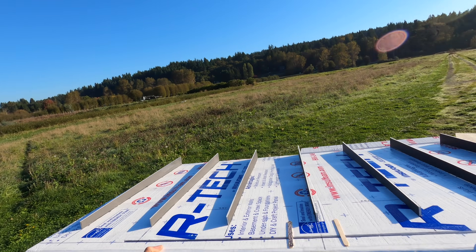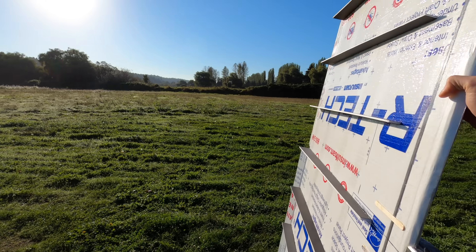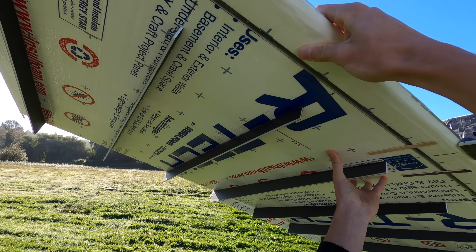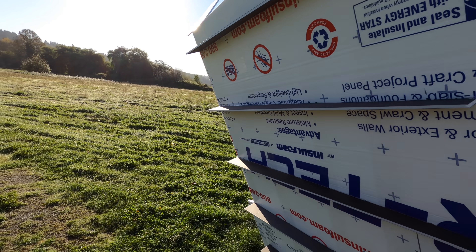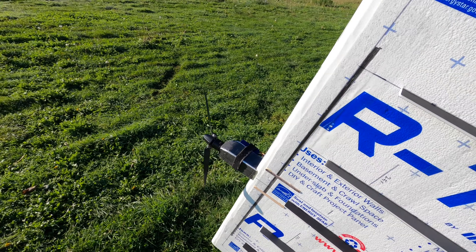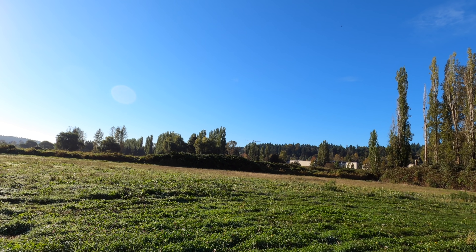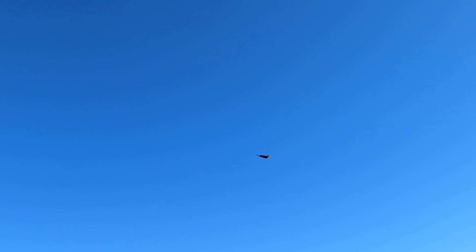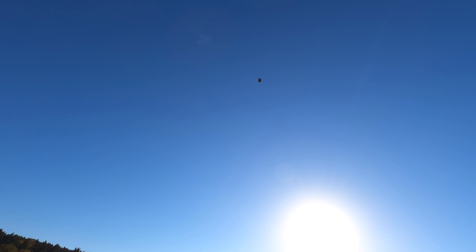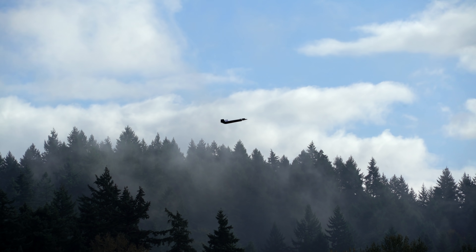Today I've got some vertical pieces of foam on the bottom to stiffen the wing on the pitch axis. They're an inch tall in the front and two inches tall in the back, which should also give it a bit more yaw stability. I'm hoping they don't act as a diffuser and create a low pressure area on the bottom. After some successful test flights with the fins, I put it in return to home mode — and now it's flying itself. Hasn't nosedived yet. It's doing it! So majestic. After that, I spent a few more days tweaking and tuning settings until eventually it was flying really well in return to home mode.